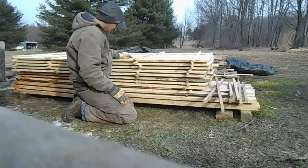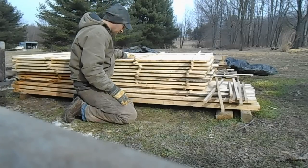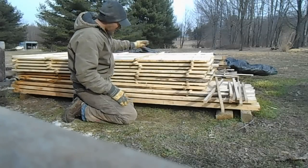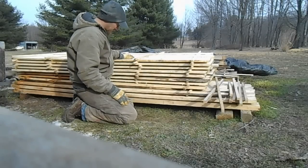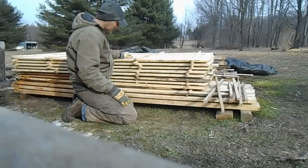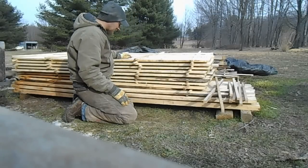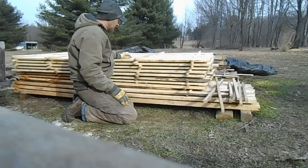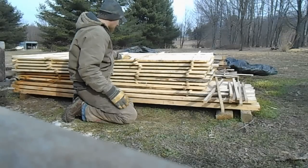This prevents your boards from warping and cupping. It does take roughly a year per inch for lumber to dry. With the pine family — this is spruce — it seems to be about six to eight months before it's ready to work with. That might be different for furniture, but I have also built with green lumber. We're just going to go over and stack some lumber.